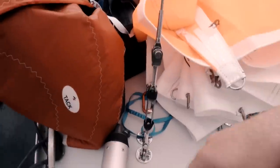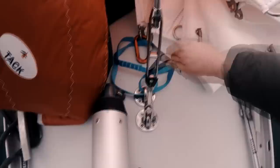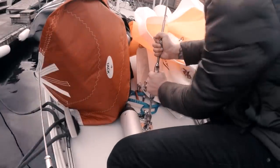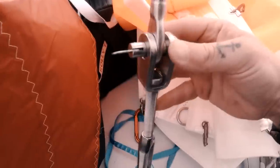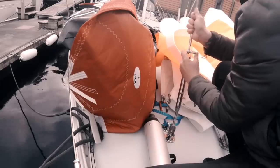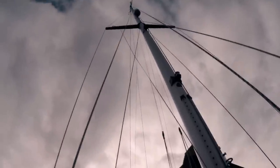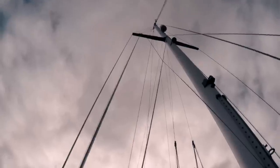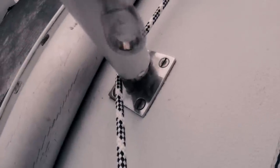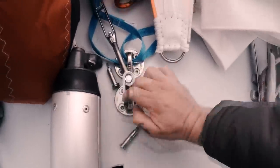The stay goes from the deck all the way up to almost the top of the mast. It's a detachable forestay — if I take off this smart pincer and unscrew it, I can release it. Instead of traditional bolts with split pins, I have drop-nose bolts — you just flip out the end and take it off. Then the stay is loose, and you can hook the wire up on a hook installed on the starboard spreader. Then I just tie it off on the deck fitting for the turnbuckle, remove the turnbuckle, and it's free.